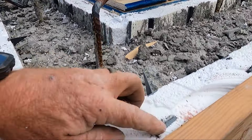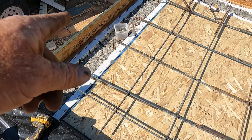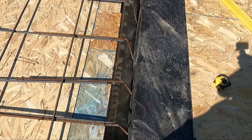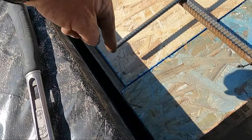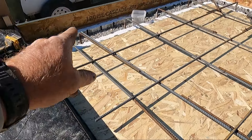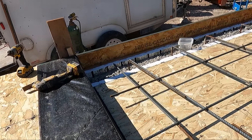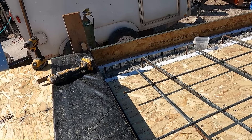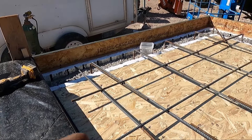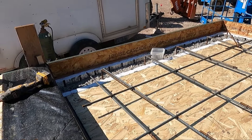You can put screws into every one of those ribs every six inches — better than a stud wall in my opinion. The 12-foot verticals go all the way into the wall. I want that cap to land on the concrete for good bearing weight. I've got to put chamfer strip on there, then I put house wrap on the face board, because when you strip it the moisture sucks into the wood and can pop the face of your concrete off. Stopping the water makes your stripping and rubbing a whole lot easier.